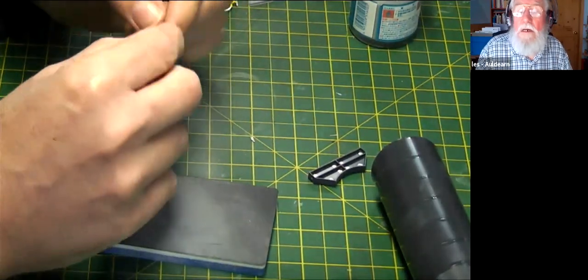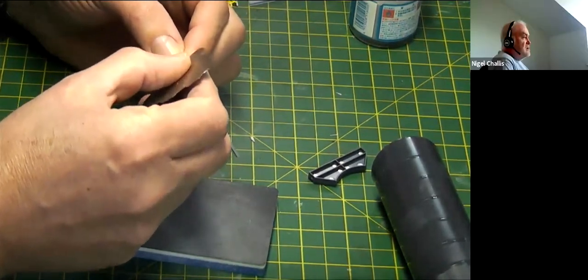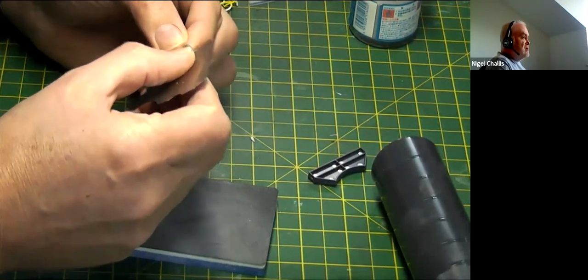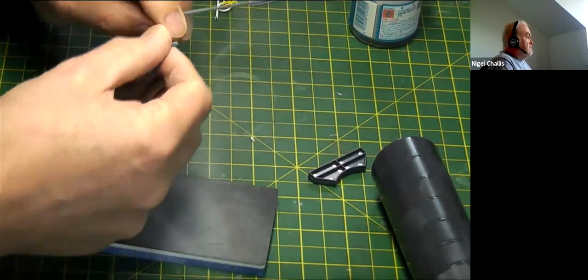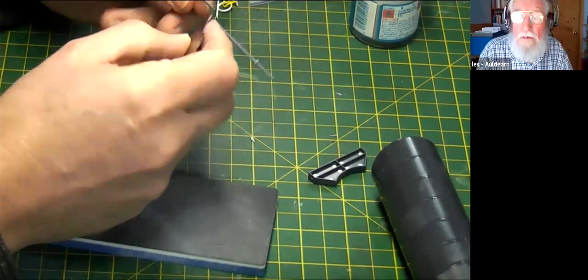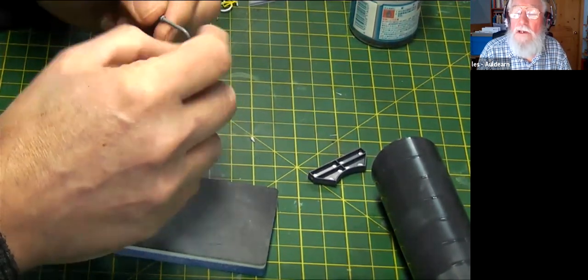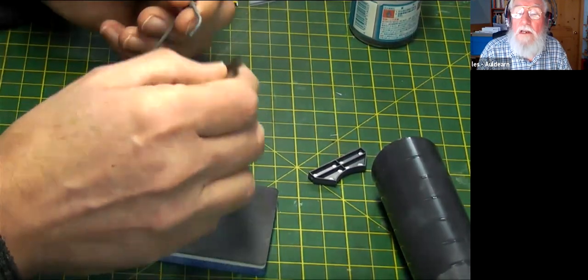The other thing you might find, although this does tend to apply more to metal than plastics, is you file across the piece, not along it. If you're filing along the length of a piece, you'll get a bow in the middle of it. But if you file across at a slight diagonal angle, you'll get it much flatter. I'm guessing it would apply the same with plastics. It's just quite how to use these. Yeah, I've found that too, Nigel, that the diagonal sweep of the file gives you better accuracy and actually a better finish. You can see on the surface how it's going. It just happens to be the way the light falls, I expect. And then as Andy was saying, draw filing to get a nice finish at the end.